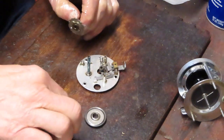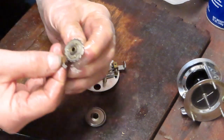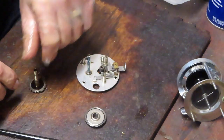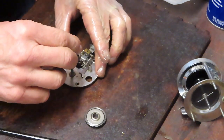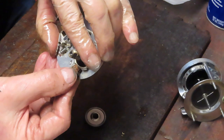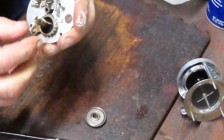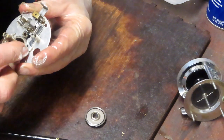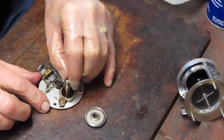And then what we're going to do is we're going to reset this dog. I took the dog off to check it. You're going to reset the dog so that the beak goes into the slot like that. And then we're going to remember that it went around this post here. So when we go to load the assembly in, let's go over the post and aim the hole in the dog for the stud, just like that. And then just like before, we can test this. You can spin that. You'll see that the dog kicks out, tighten, and the dog kicks in.